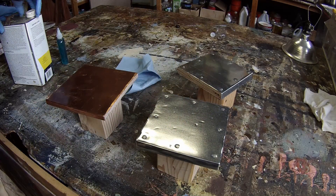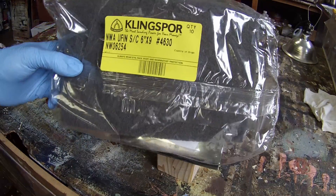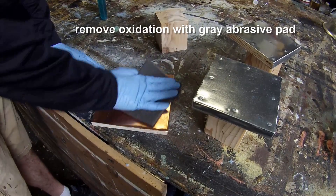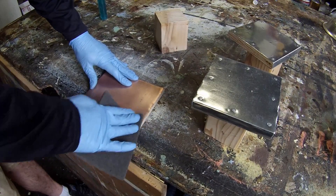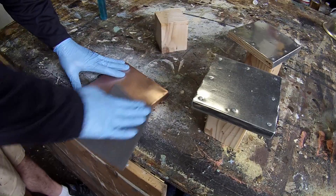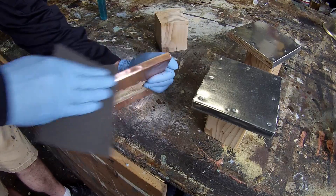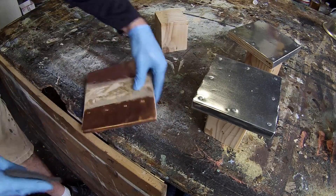The next step is to scrub the surface with a synthetic abrasive pad. These pads are made by Klingspor and this brand lasts a little longer than store-bought brands. Make sure you use the gray color because the grit is color-coded — gray is a finer grit. They also come in green and maroon, but avoid the coarser grits because they will leave scratch marks. Also avoid steel wool because any iron residue will stain the patina, and steel wool has residual oils that will also affect it.